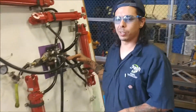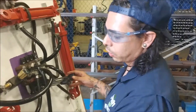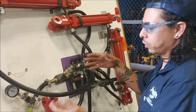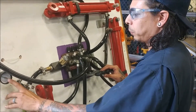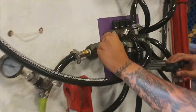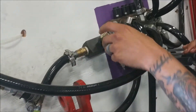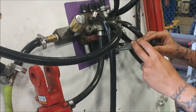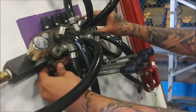This is usually set up on a hydraulic system, but today we can rig it up with pneumatic. We've got our supply — this would basically be the pump supplying fluid, but in this case it's supplying air through the system. We've got a little pressure gauge to make sure we don't blow any lines out, and a variable control so we can add or take away pressure. Here's our monoblock valve, a four spool valve system.